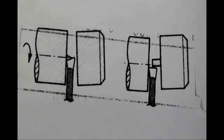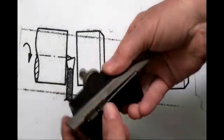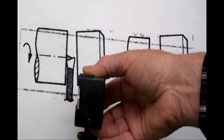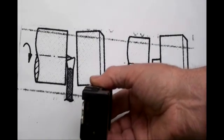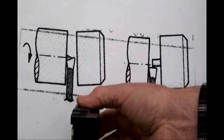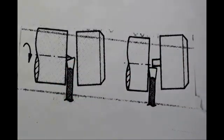In all my work on turret lathes, where I probably made millions of parts using power feed with flood coolant, cutoff was never a problem — you never even thought about it. But most of those cutoff tools on a turret lathe are mounted upside down on the back of the lathe. We don't have that capability on most of our lathes, but turret lathes usually put the cutoff tool upside down in the back and you feed out to cut it off, which is very effective.